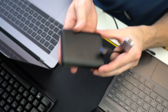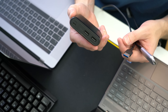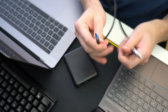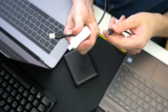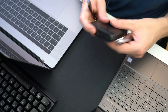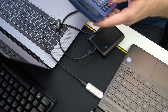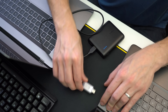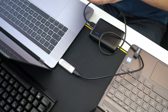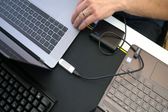In this next test we're going to use the Anker PowerCore 10400, a USB Type-A power bank. Because it's USB Type-A, we're going to use a USB Type-A to USB Type-C cable and put that through the USB Type-C power meter. This is with the laptops off. We get 4.9 volts times 1.3 amps equals 6.3 watts. In the MacBook Pro, consistently getting 4.72 times 2.3 amps equals around 11 watts — a lot better, though the MacBook Pro battery is quite a bit larger.